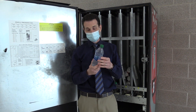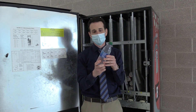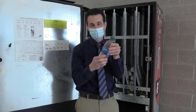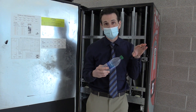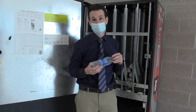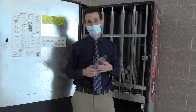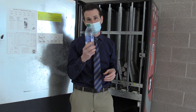Something else to consider is if the bottles are too squishy for vending. These consumer water bottles — these 16-ounce water bottles, whether they're Dasani or Aquafina — sometimes they don't vend very well because the plastic is so thin. If you're trying to vend bottles like this, what you might have to do is just not stack them real high up. I usually have them in two columns and don't go more than halfway up on the machine. If it's a really squishy bottle, I don't even go up that high. The way to avoid this is to get the 20-ounce vending water bottles that the bottlers provide — they have a firm plastic shell and they typically don't jam like these could possibly jam.